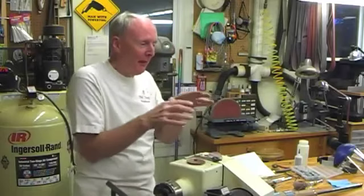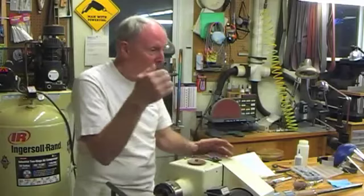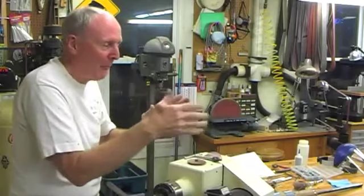But I can't stress enough the way of stepping your way down. Because if you don't do that, if you go down a quarter inch, and then you come back up to clean up a little bit, that thing's out of round already. Oh, yeah. And you get some serious problems.